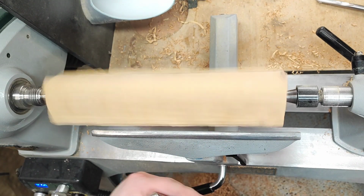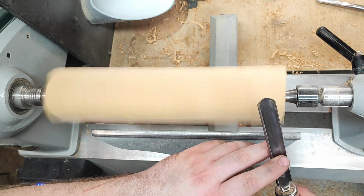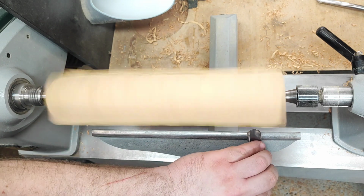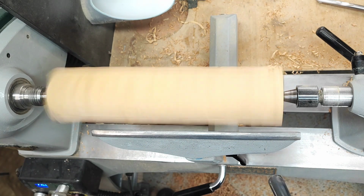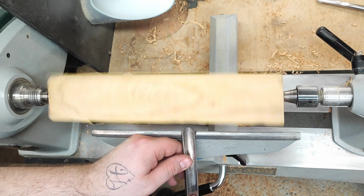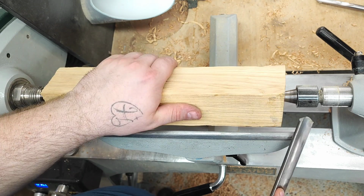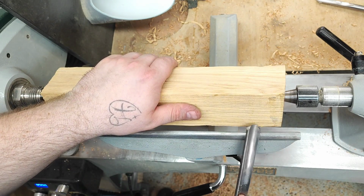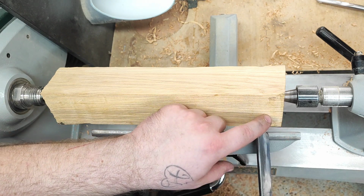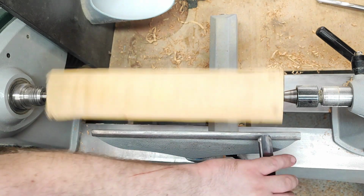So it's to always make it round. So I use this. The rest is pretty much so the tool cuts on the center at this stage. So you can drop the handle and just go from. First of all, this is quite important. I see a lot of people start at the middle and then go here. It's much easier if you scoop a piece here and then follow that. That way the tool goes into the piece that you already cut. So it looks like this.